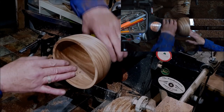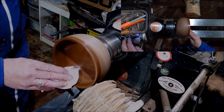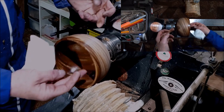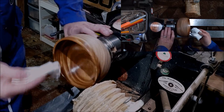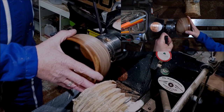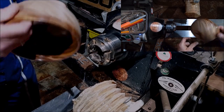Yeah, that'll do it. Now in here I'm going to sand and finish, so I'll be back when I do that. Just putting the wax off the inside of the skirt, and that turned out quite nice. Now you'll see why I wanted to leave the base thicker — the gold is flashing quite nicely. Now what I'm going to do is take this off and make a jam chuck for it. Off it comes, and we'll make a jam chuck for it.